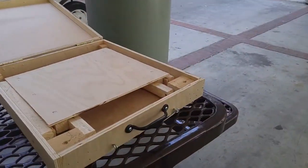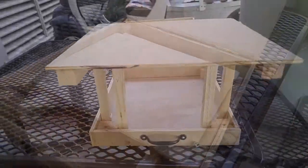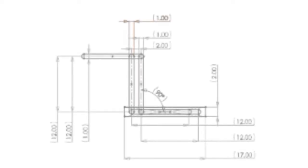For the kinematic analysis, the initial position of the 4-bar linkage was at 0 degrees. When extended, the 4-bar linkage can reach a maximum angle of 90 degrees. When the laptop is extended 90 degrees, it has a vertical height of 1 foot. It also has a horizontal distance of 10 inches, allowing the user to have a better posture.